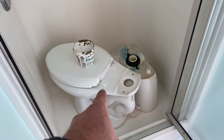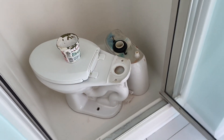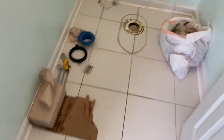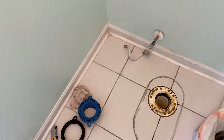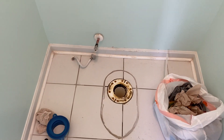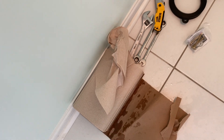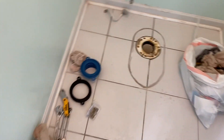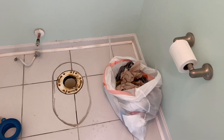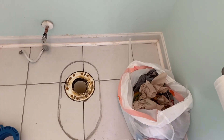Then I'll go ahead and lift the toilet out, set it over, get it in there. It is going to have water in the bottom — try to be careful, but it's going to slosh some out too. I'll clean that up. After that, you're going to have that wax ring down there. I've used little putty knives or drywall knives to kind of scrape that up, and then throw it in a five-gallon bucket. But I've learned it's better to have some paper towels or rags and a trash bag ready to scoop all that up and get it in the bag. Because whatever it touches, it's going to be there from now on to eternity. I don't like to get it on my tools or in a bucket — the only way to really get it out of there is to probably heat it and boil it out.